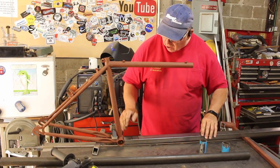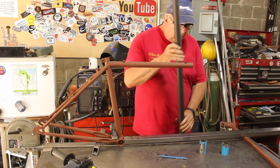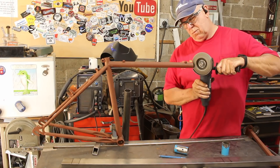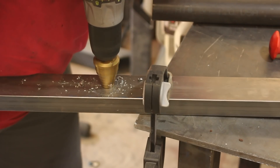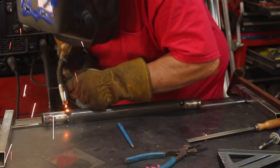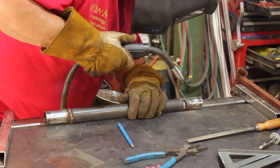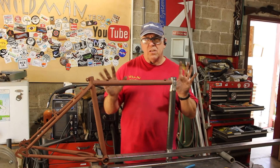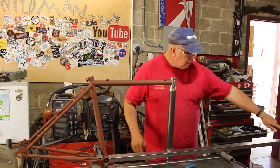This is more than long enough — I've contoured it to fit the bottom bracket. Now we need to cut the tube for the new steerer tube. I didn't have the right size tubing for the bearing cups for the steerer tube, so what I did was take a head tube, cut it in half, and weld it onto the end of an extension tube. This is going to be my primary head tube where the steerer tube goes through. This is my steer tube, and there's going to be a connecting rod out to the front wheel.